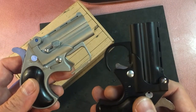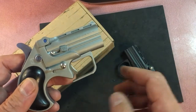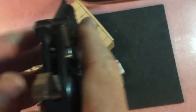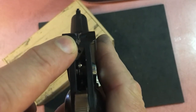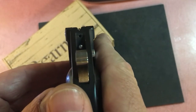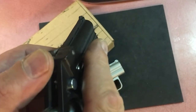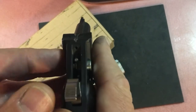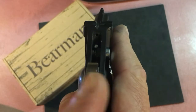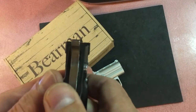We'll give it a try and I'll add another video to let you know. We're coming up on about eight minutes so that's about the end of this video. If you're wondering what this slot is here — we took a file and filed the rear slot to try to lower the sight, which it did about eight inches, because these do shoot high. That's a little trick I do on my black powder guns that have the rear sight built into the hammer.